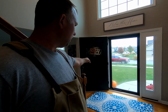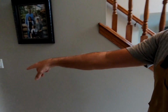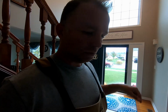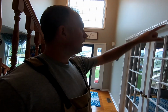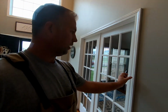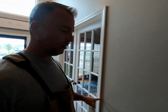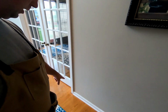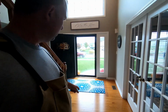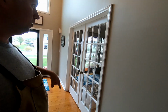Pretty much around behind the door, this wall here, and then the wall here under the stairs, and then right up to these corners. So, first thing I gotta do is destruction. I have to take all the molding off the bottom and these two door casings off. I have new door casing that's thicker to accommodate the 1x that's gonna make up the wainscoting that we're gonna build. So I'm gonna go through and rip all these pieces out, all the base molding, quarter round, all the way around the room, and then we'll measure out 6 pieces for these doors of casing to cut out.